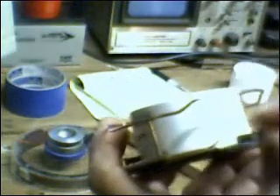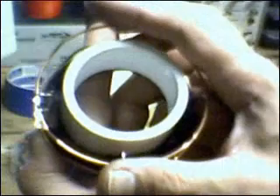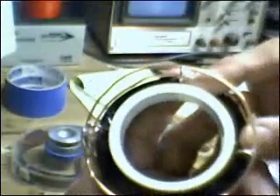About four millimeters — that may not be enough. When I increase the angle and increase the length of the incline, what happens is the overall diameter of the raceway ring decreases, which is not a big deal because I still have plenty of room inside the bobbin to accommodate for that. I can easily adjust the length of the arm that controls the stator to reach further in as the raceway becomes smaller. But it's going together very nicely. Tomorrow evening I will be putting together the roller bearing at the end of the arm for the stator, and hopefully giving this thing a test run tomorrow, if not the day after.